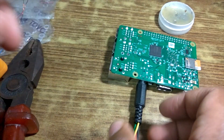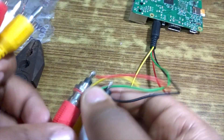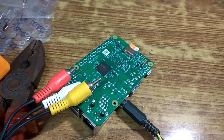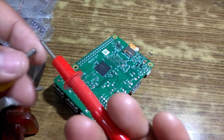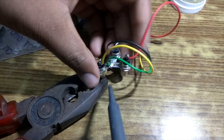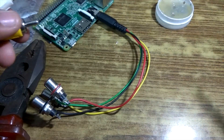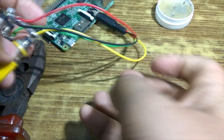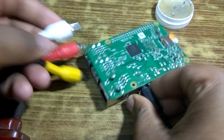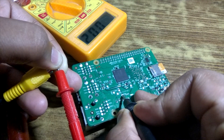Now all the connections are made and I have also connected the RCA cable — the red one goes to the red one, the white one goes to the black one, and the yellow one goes to the yellow one. Now I just need to check if they are connected in the right way. I have my multimeter here to check the continuity and verify which is connected to what. All of them are firmly connected. Let's check if it's actually connected correctly — yes, it does actually work.